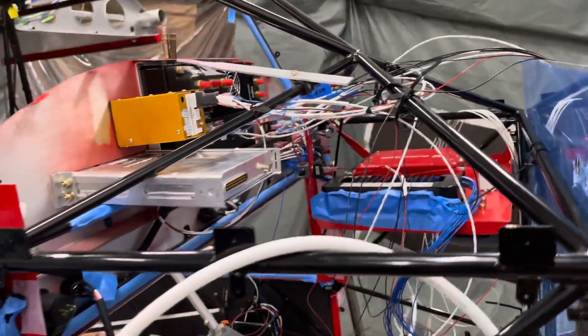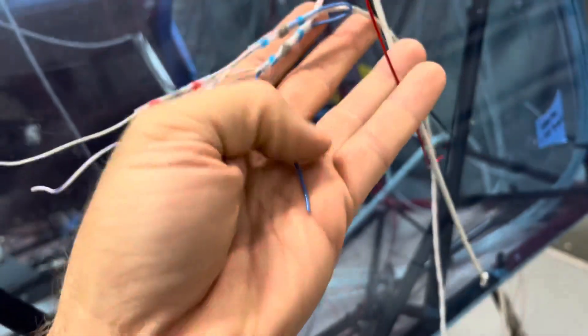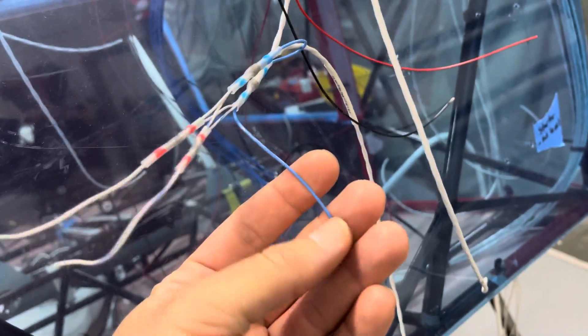There's trim, and here's all the Garmin wiring. Pretty straightforward — I've been using solder sleeves. This is a CAN node, so CAN comes in, goes into the device, and loops back out to another device, with all the shield drains. There'll be a ring terminal here onto the shield, and here are the pins.